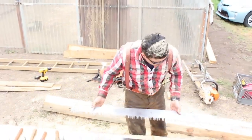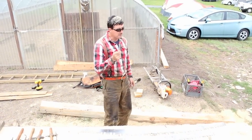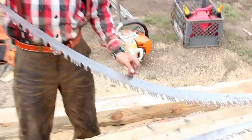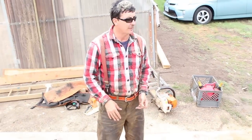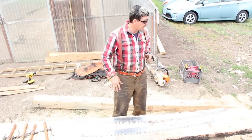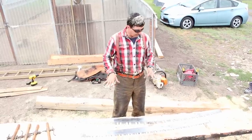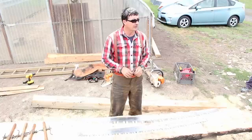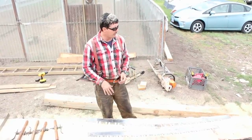If you're looking for used crosscut saws, carry a sheet metal gauge in your pocket — I keep one with me because I'm always stopping at garage sales. Check the thickness at the middle and the back: if you've got four or five gauge thicknesses of taper from the middle and two or three from the spine to the teeth, you have a crescent-ground saw. If it's not pitted and the rakers aren't broken, buy it. A saw like this — my grandfather's, bought in the 1930s when they moved to Idaho from Oklahoma — is worth five to six hundred dollars just for the blade, and only going up.